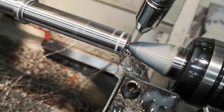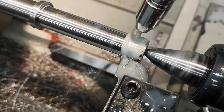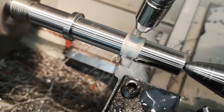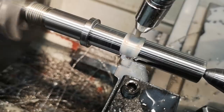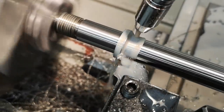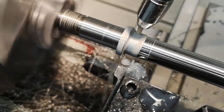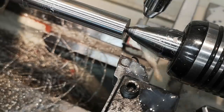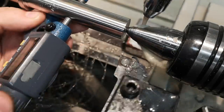When it comes to me — and many of you — not having access to a CNC lathe with live tooling is a bit of an issue. You could probably get away with threading this. It's a 10mm pitch and you'd need a tool that was ground with a 10-degree angle so it didn't interfere on the threads. I can barely grind coffee, let alone a tool like that. I tried it quickly and it didn't work out so well.